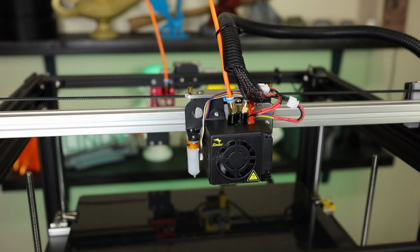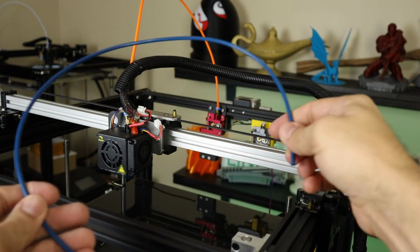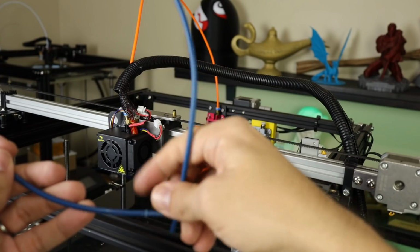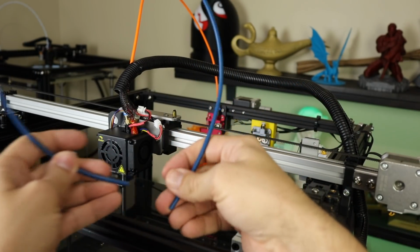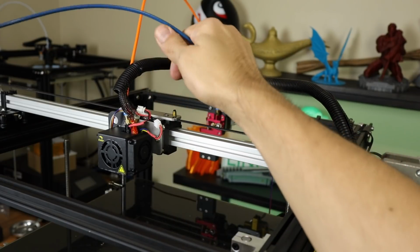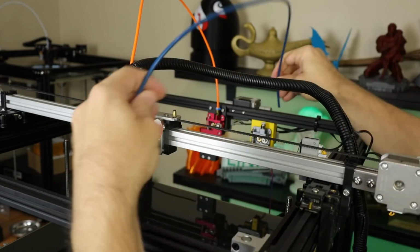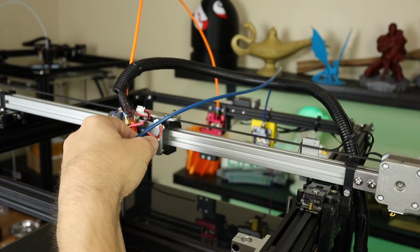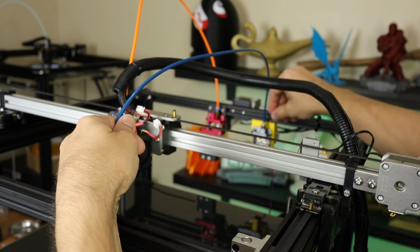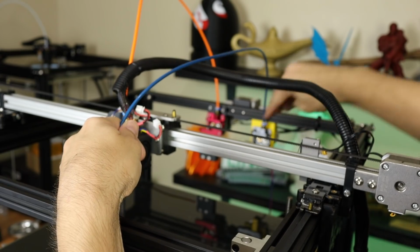Now we need our second Bowden tube. Okay, so I've taken my new cut of tubing, which matches my first cut of tubing in terms of length. This is actual Capricorn tubing. This is tubing from filament 1. I'm going to take this one, just put it back in my new extruder in the back. Take the coupler spacer, put that on there. We'll keep that in place.